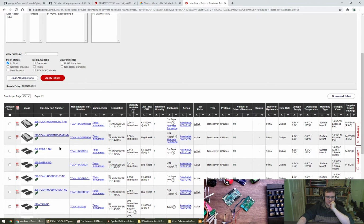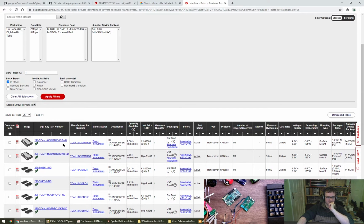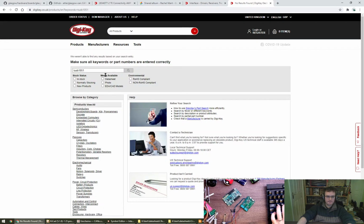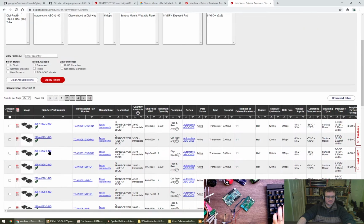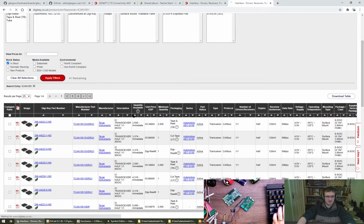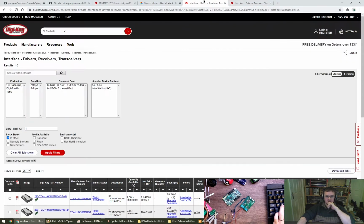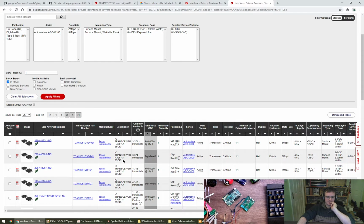So this is one that's already in KiCad. It's £1.40 in one-off quantities. Let's have a look for the TCAN1051 that I've been using. Oh dear, that's not it, so brain in the wrong place. In stock. Unit price, so that's sort of 86p. Yeah, it's about twice the price, isn't it? Let's go for it. I've used it, I know it's good for 5 meg, or at least the datasheet says it. I haven't actually used it that fast. Huge mood, yeah, definitely.